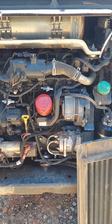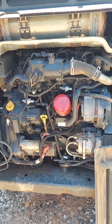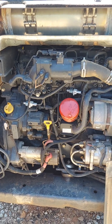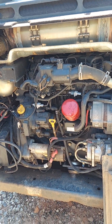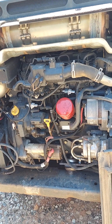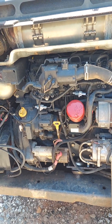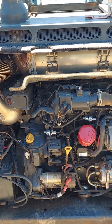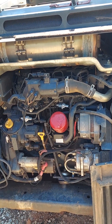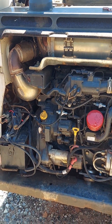That's what fixed it on this Bobcat with that code that kept coming up. I've read forums about this and it's a common thing on Bobcats with the whole DEF system. The code was U0032-2619. Sometimes you might not get that exact code, but you will get an SCR or a code that says tempering fault.